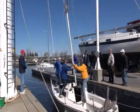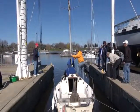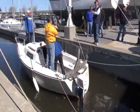Two people must hold the mast at the base and walk the mast forward from the stern as it is raised. As the mast is raised, one person on board the boat must check for snags and release any stays, lines, and so forth that get caught.